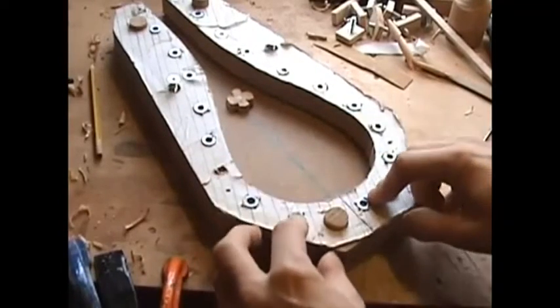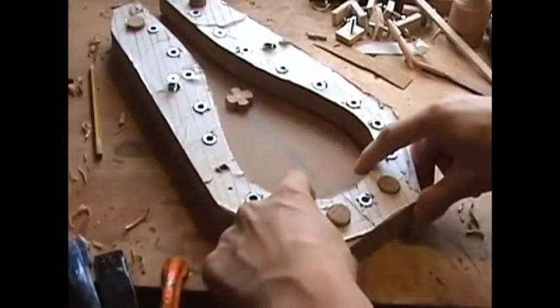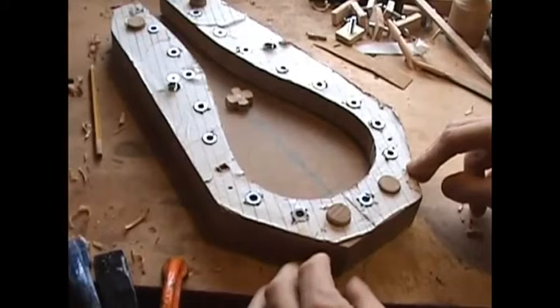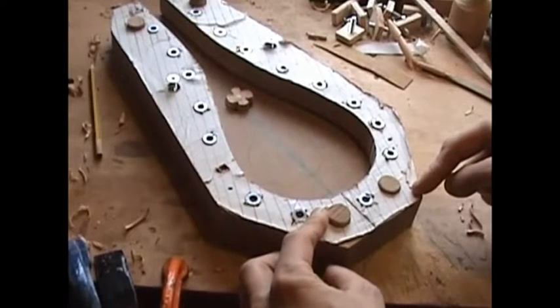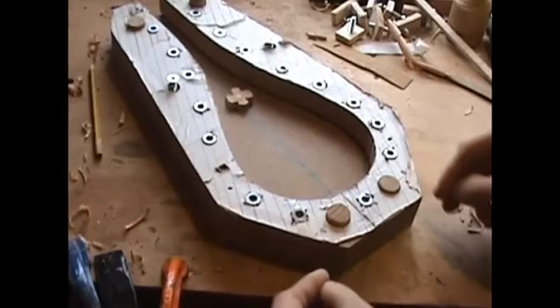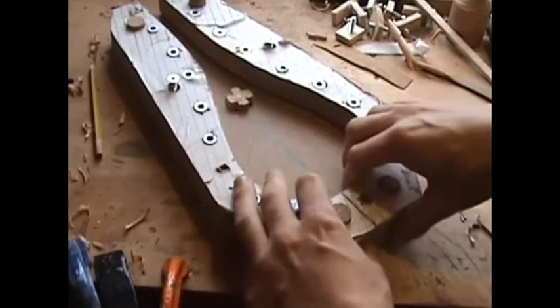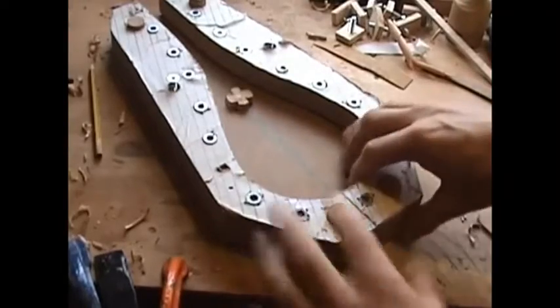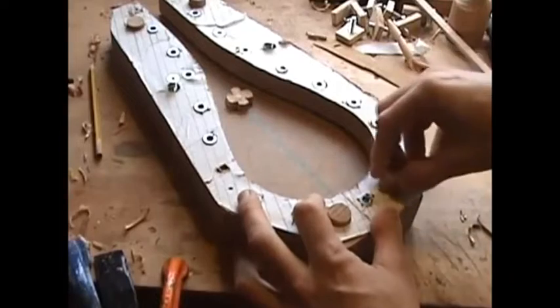Alternatively, you can make a small hinge so that these two pieces can be hinged or screwed together. There's several different ways you can do that. You could have some sort of rod connector between them, or you could make it so that this is squarer so you can clamp it. It's up to you how you do that, but just a quick update so that you know to make this in two halves. Or you can modify your existing mould.